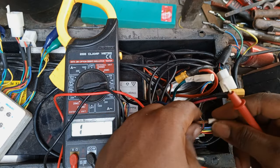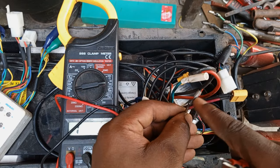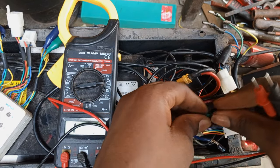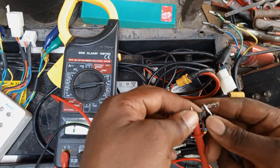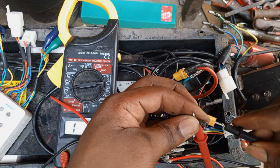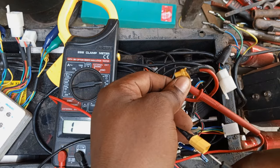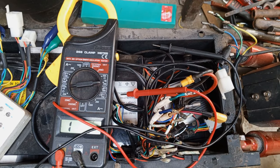Let's test one more time to make sure everything is okay. You can see that even the yellow connector looks bent, which means the connectors have been getting hot while it's working — that's a sign of a bad motor. Let's test across phases and test against power again: yellow against power, green against power. There's no issue with the controller.